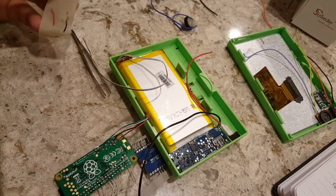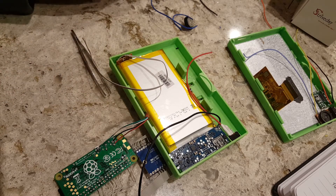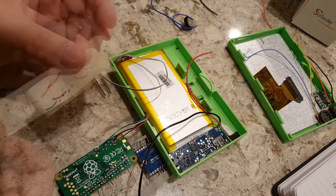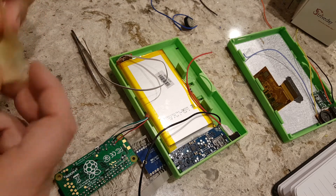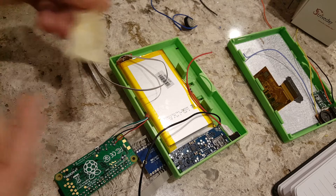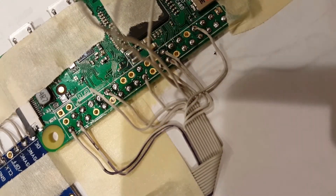Remember that next time you're trying to solder something that's moving — just throw a piece of tape on it. When you're done, pull it off and you can use it to help clean up and pick up your little wire pieces. Works pretty good — just fold it over and you don't even have to sweep. So this is how I solder these ribbon cables: they shrink quite a bit with heat, the shielding does.